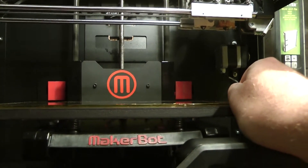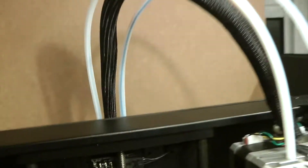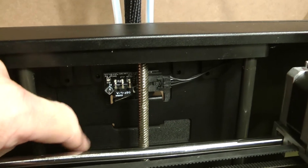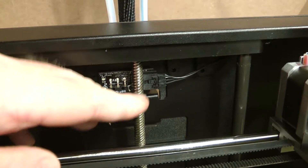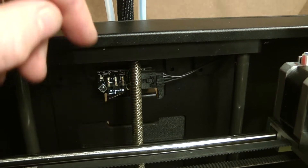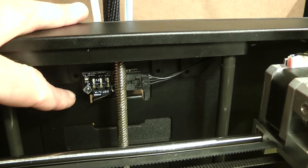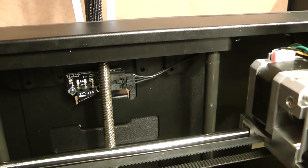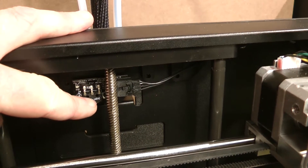What I ended up doing — but before I show you what I did, there's another way you can do it. That is to actually move the position of your limit switch. In my case, technically my build plate has come up 2mm higher, so I'd need to move the limit switch down 2mm. Apparently there's two positions for your limit switch — one's on a slot, and there's two holes. I haven't actually taken it apart to have a look, because I did it by a different method.